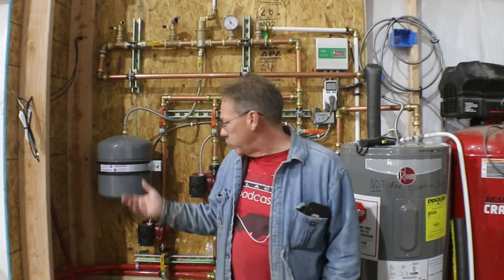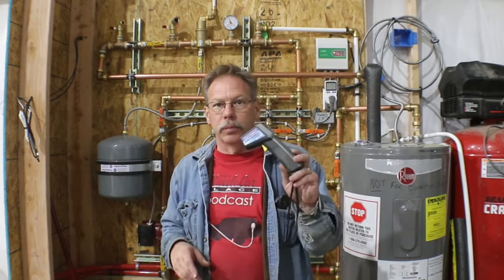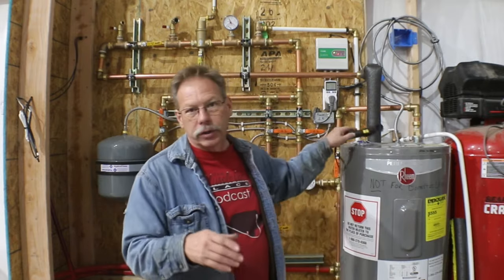I had tweaked the system a little bit. You know, the basics are you play with the inlet and outlet flow rates to try and balance all the loops, and I've just been doing that with an infrared thermometer gun here. And if I have loops that are returning much warmer water than other loops, then I've been slowing their flow to get that water drawn out and into the floor.